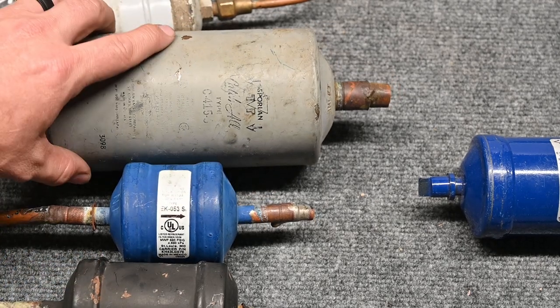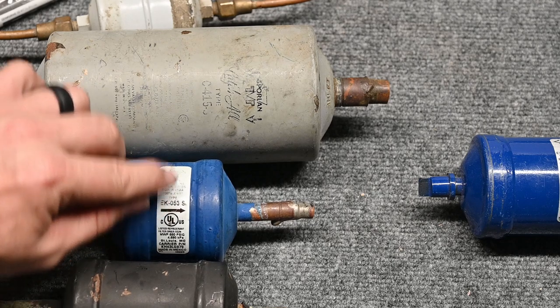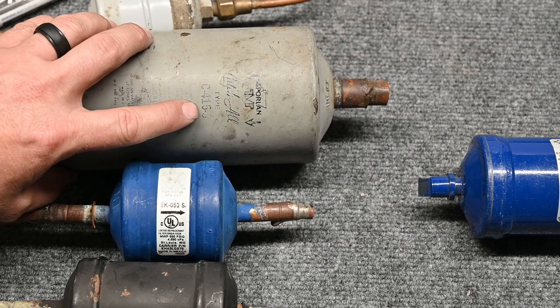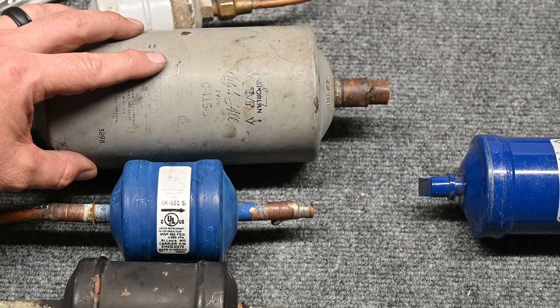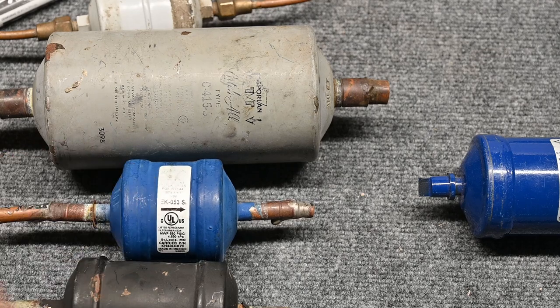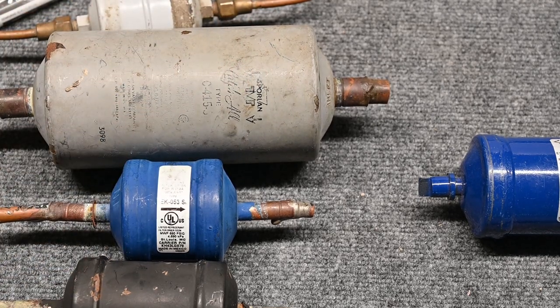If we look on this one, it's a 41 — so it's 41 cubic inch desiccant area. It's a huge filter. This one's a half-inch, and the 5 stands for a half-inch line size. So the line coming in here is half-inch outside diameter tubing. This filter dryer will hold a whole lot more contaminants than the smaller one. The idea is that your filter dryer can be larger, but never smaller than what you need. Typically in residential, I would carry 5-ton filter dryers, because a 5-ton would replace a 4-ton, 3.5, 3, 2.5, 2, 1.5, 1 — all those different options. In residential I just kept 5-ton filter dryers and made them work in most scenarios.